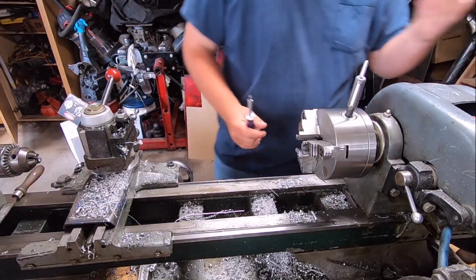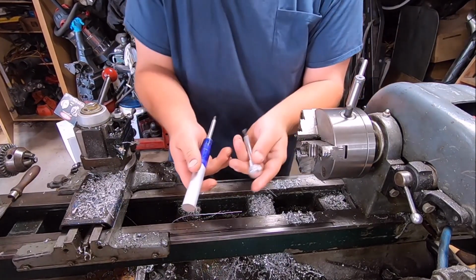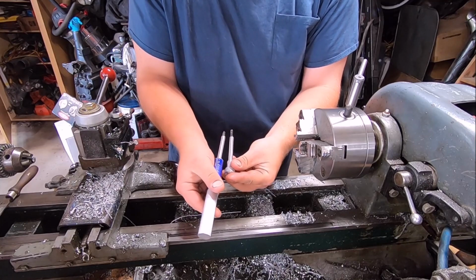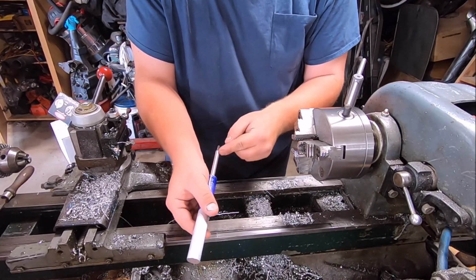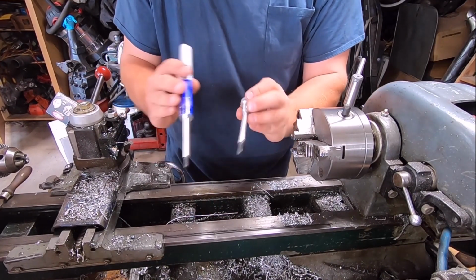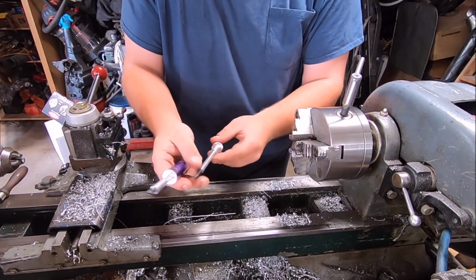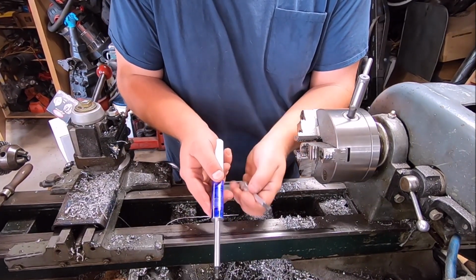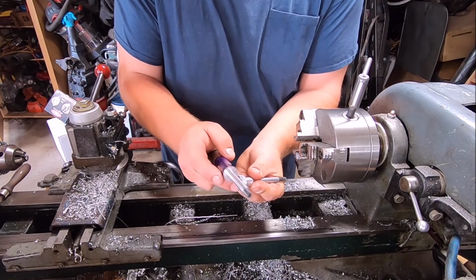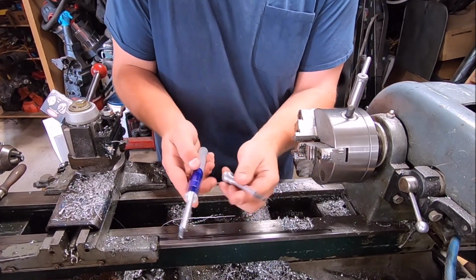So, to get to this point, we had to start off with round stock. It's 3/4 inch diameter. We have now machined it down to where those are almost identical lengths on the shafts. This slides through the valve cover, and then your stud sticks through. So I actually drilled and tapped this one deeper. I will come back and do that to this one too. And this mark on the dial indicates the tip top of this crown. So we'll have to machine this crown in on this one, just like we did on this one.